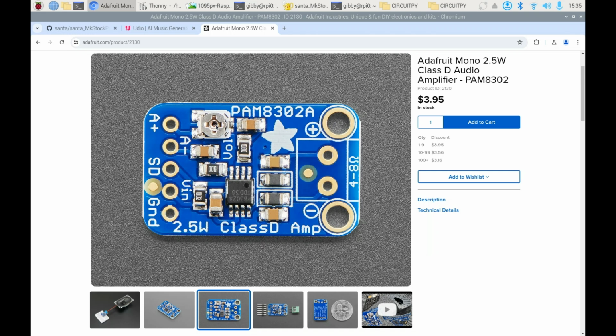It comes maxed out and it will have a bad hiss because of that. You don't want it cranked to 11 or 12, right? So any dead sound, any quietness is actually just a loud hiss on this thing. You need to turn it about a half a turn to the left to get rid of that hiss. It'll still be plenty loud for all of the phrases that you need to play.